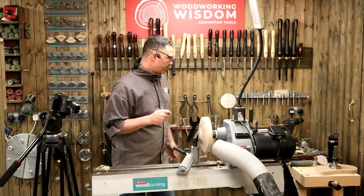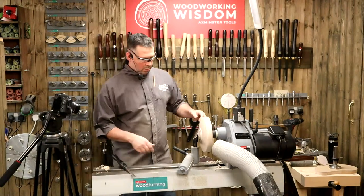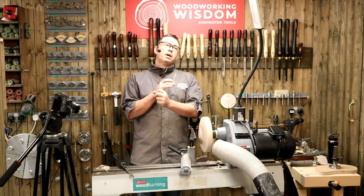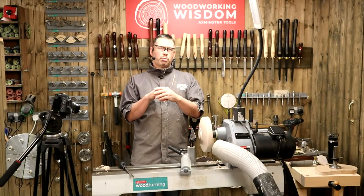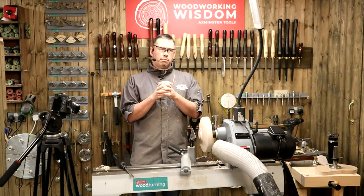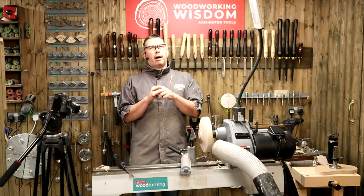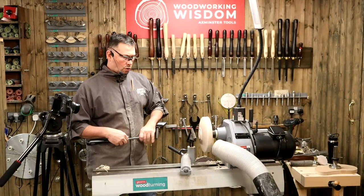Yes, another question, Ben. And Robert would like to know, what kind of angle would you recommend on the long grind bowl gouge? A long grind bowl gouge, probably about 45, if I'm honest. If you wanted to go for a spindle detail gouge, then I'd probably go right the way down to 40. But 45 is pretty good on a long grind. I tend to go with 55. It's more an Irish grind, 55 degrees. And it's an all-rounder, not too aggressive either. But 45 on a long grind, yeah.